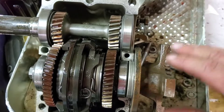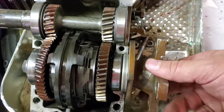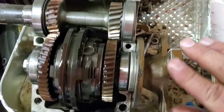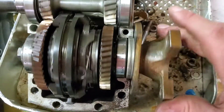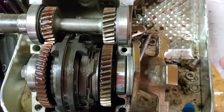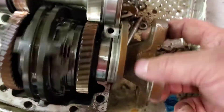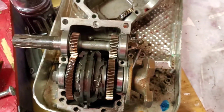Alright, here are the new bearings installed, and that turns real nice. You can see here too how it spreads the — this is just lubricant left in the teeth. I completely drained this thing. That was real nice. So I just got to put it all back together again — make sure there's no foreign material in there, which I don't see any. Now it's just a matter of remembering how it goes.